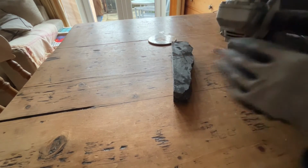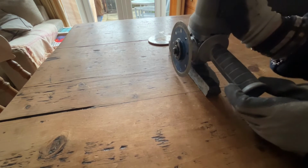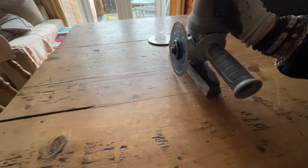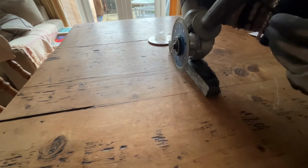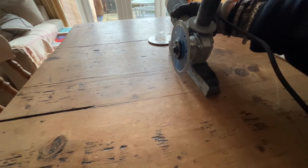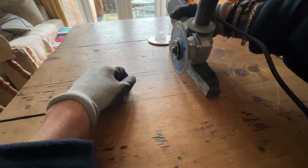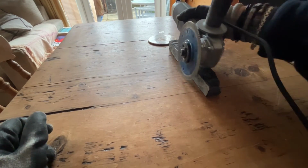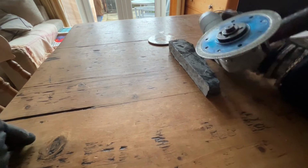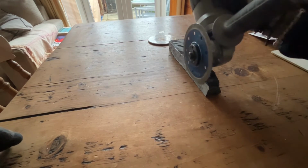And I'll show you. Now this is a bit of the granite that was cut off. If I place the tool on here, you can see that the blade doesn't go all the way to the bottom. And even when you orientate it, you've still got about, I'd say 4mm gap there, but it did cut nearly all the way through. I got around the problem by just knocking the bit that was cut off and then tidying up the edges with the blade like that.